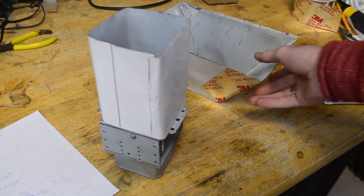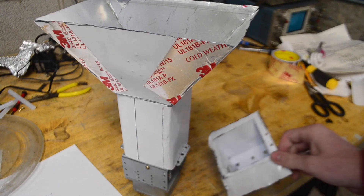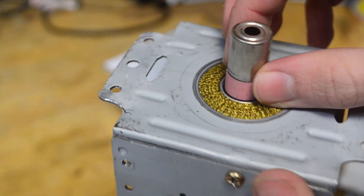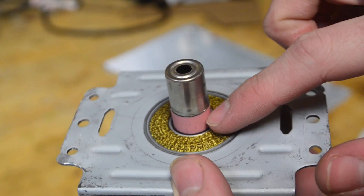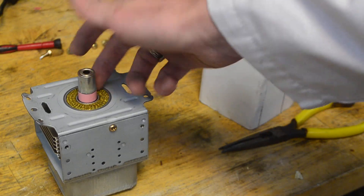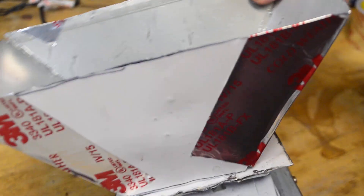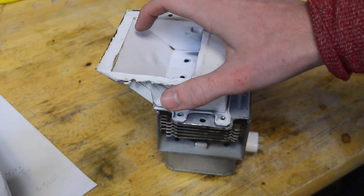Our plan was to have this small box here and then put the top on like this. However, I figured it would be much easier to attach this to the magnetron using this piece — which is what the magnetron was originally sitting in when we first opened up the microwave. I took my angle grinder and somewhat crudely cut out around it so we could pull it out. Now although you'd expect the microwaves are being emitted out of the top part, they're actually being emitted radially from this pink beryllium oxide. Be very careful not to shatter this pink part, because it might be made out of beryllium oxide and if you shatter that and breathe it in, it'll be very bad for you. I assume this angle is actually 35 degrees, so that should mesh together nicely with the waveguide I've made. Now I'm going to attach this back onto the magnetron and screw it into place.